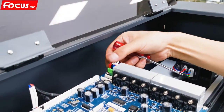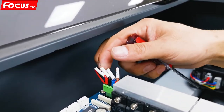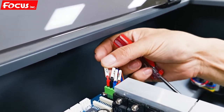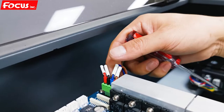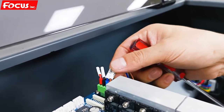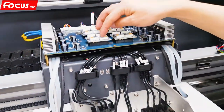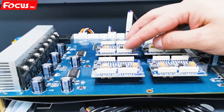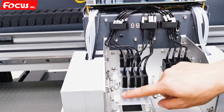Here is the power port for the carriage board. It has different levels of power: 42 voltage plus and minus, and 24 voltage. These four cables must not be switched — normally you do not need to change or reconnect them. If we change the voltage connection, we will damage the print head and the board. We can also see the connector port for the print head, and here is the ink damper and the ink damper holder.